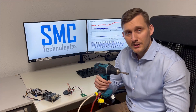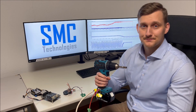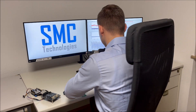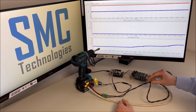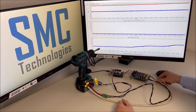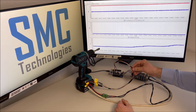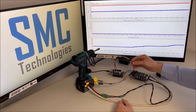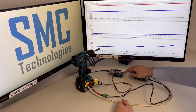Let's put it all together and see how the sensorless drill works. We have connected the 18 volt battery power supply to the inverter and also plugged in the three phases of the BLDC motor. Further we have connected the five wires for the potentiometer button and the switch for the speed direction change to our control board.